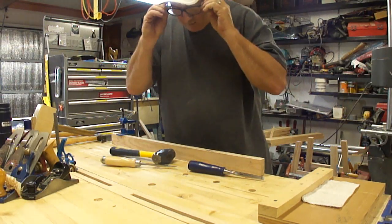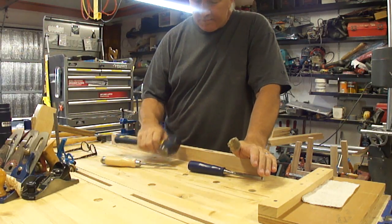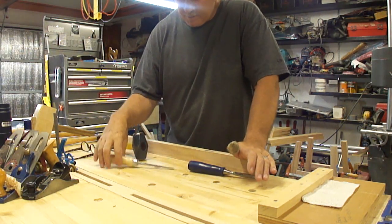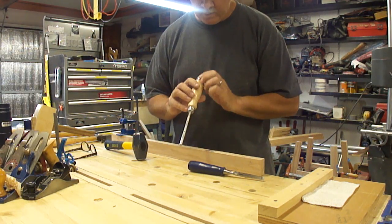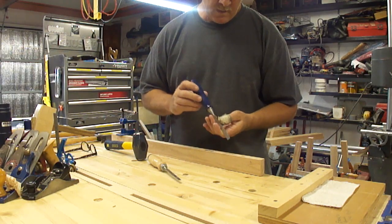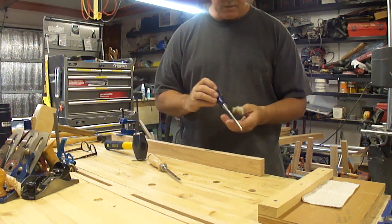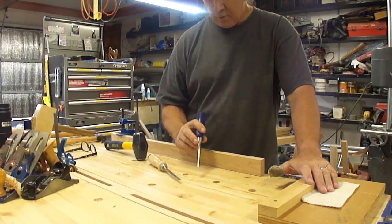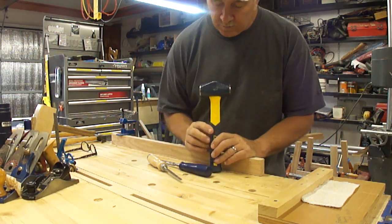Hello. I'm going to talk to you for a minute about mallets. I have another video where I was chopping mortises for a stool and I mentioned that I was using a two pound sledge hammer, and it occurred to me that needs some clarification because I was chopping with standard bench chisels. You could almost do a video just on that — using bench chisels to do mortising. I like to use them because they're light, fast, and sharp. They're fast because you take small bites and move quickly, dropping depth very quickly. They cut really well. I thought it was worth some clarification on how I'm using the chisel, because it's not evident in the video. I'm taking a two pound mini sledge.